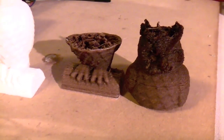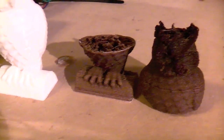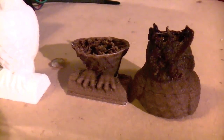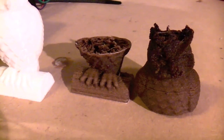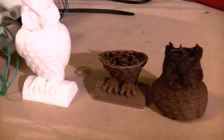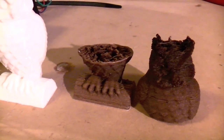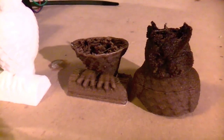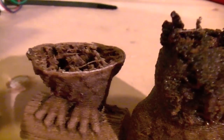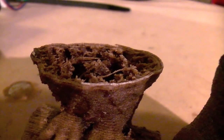The reason it broke in half was because it jammed up slightly. This isn't surprising, as it does have 40% wood inside the filament, and this sort of gets jammed up in the hot end. Mid-print this happened and I had to unjam it. I unjammed it with some PLA, which of course meant that there was a little bit of PLA printing out when I set it going again, and this created a weak point.